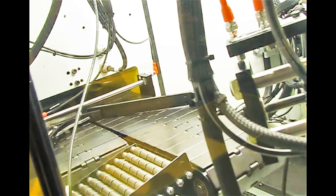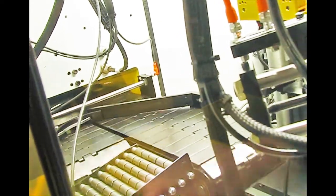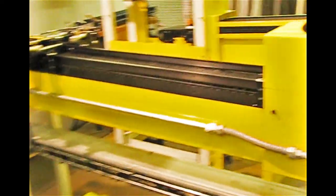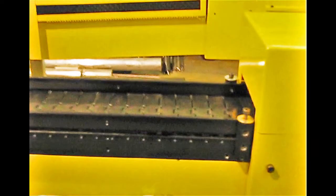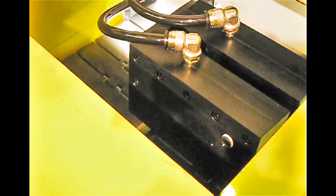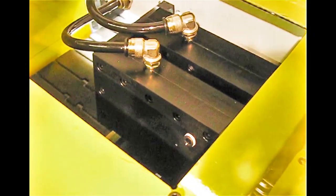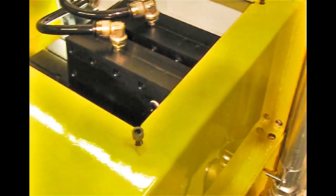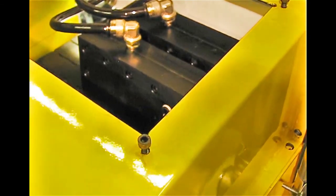You can see the QC arm engaged. The QC arm wipes the part right onto the conveyor there — it's a gravity conveyor — and the part slides out of the machine where the operator can pick it up. We have air knives here to dry off the part. We don't run them in dry cycle for air conservation, but during the cycle the robot knows when it drops off the part and it'll engage the air. We use a timer to shut the air off.